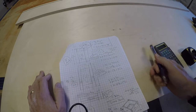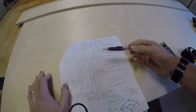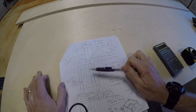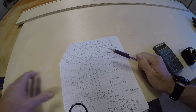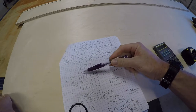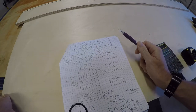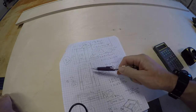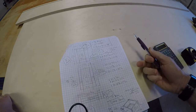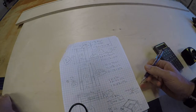If you want to pay more money, then we can make it out of solid wood with MDF panels. And most of the time, when they see jobs that are done with MDF, they can't tell the difference. So I can't either, frankly. Plus, these don't crack. So when the lacquer goes on, the doors that I make here, they don't crack. The wood won't move much at all. And so they stay flat, they don't warp, and they don't crack the paint. So it's a win-win all around.